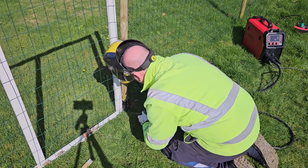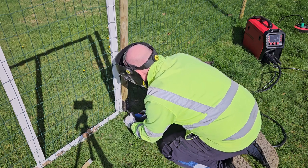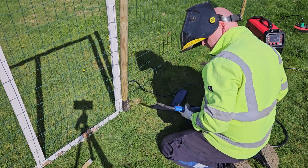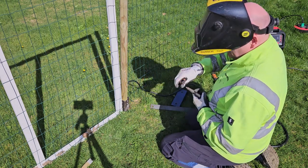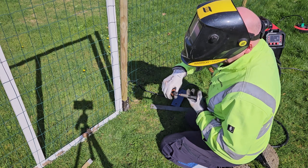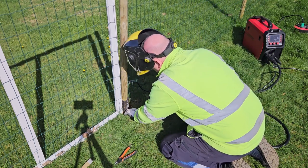It burns — it's too close to the nozzle. You have to have half an inch from the nozzle. I forget that the whole time when you're welding flux core.